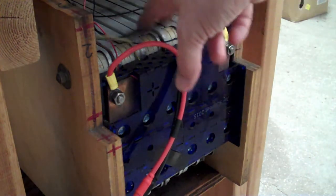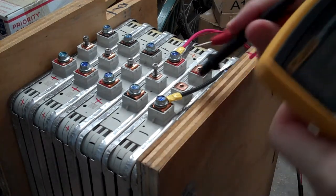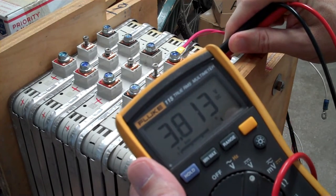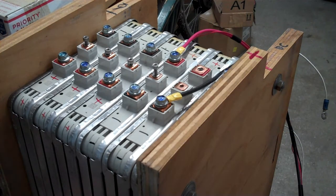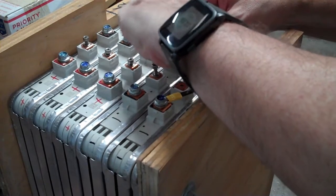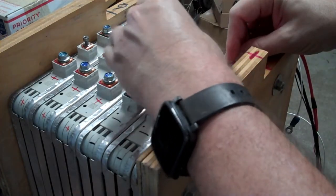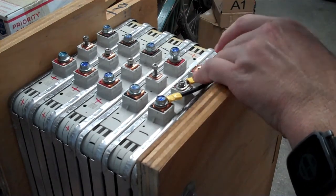Because this is a battery, I can put power back into that battery when I'm discharging. Let's say you have two cells — this first cell is at 4.02 volts and the second cell is at 3.81 volts. You could balance charge the whole module, but because they're so far off, you're probably going to be waiting for the low cell to catch up. So what I'm going to be doing is charging half of this at a time. I'm only going to be using the plus and the minus, doing it one cell at a time — so just the charger on a 1S basis. All it's really doing is looking at the ending voltage and doesn't have to monitor multiple different cells at once.